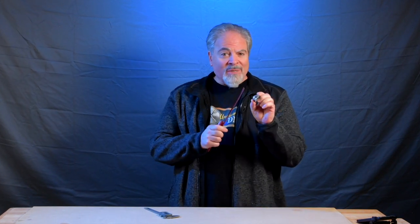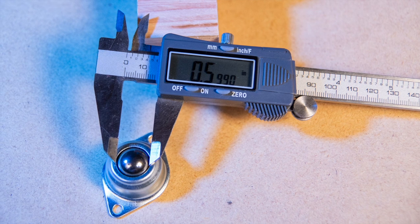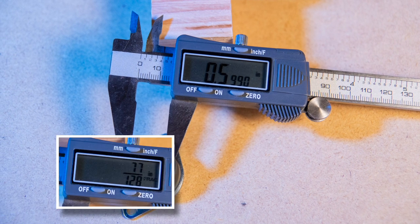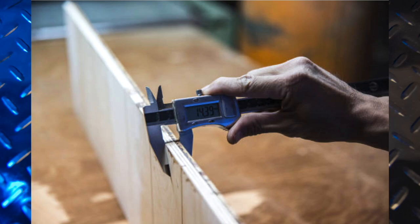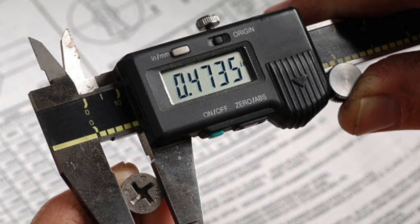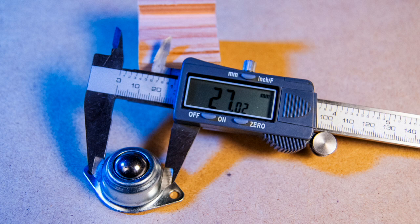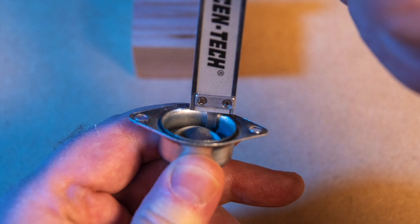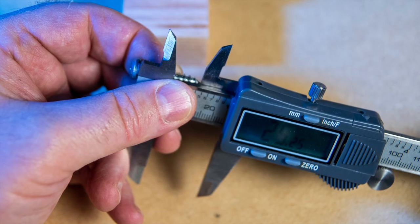Digital calipers only do one thing, and they're not the most glamorous of tools, but they sure make measuring small things that are otherwise tough to measure accurate and easy. Imagine the difficulty of trying to measure something like this with any degree of exactitude — these eliminate the need to eyeball your measurements. These have three universal systems of measurement: decimal inches, fractions, and millimeters. It's an equally practical choice for both professionals and DIY projects, and it adds accuracy down to a thousandth of an inch. The digital display is fast and easy to read compared to analog dial types. It measures outside dimensions, inside dimensions, and has an extendable depth gauge for use in slots and holes. The step feature makes it especially easy to measure things like the threaded portion of a screw or bolt.